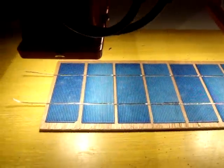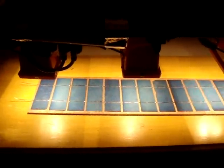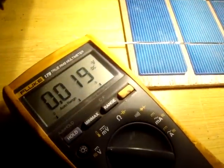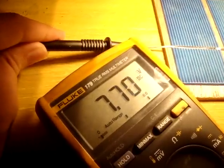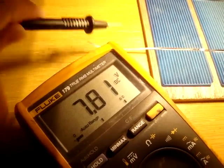I'm going to be building the final shutter slat and I'm going to be pouring a clear coat AB compound epoxy on them. But before I do that I just want to give them a test. I have a little lamp bank that will illuminate the cells so I can test them. I have my voltmeter here. With the cells illuminated I will just test them — I should get about 7.8 volts per slat.